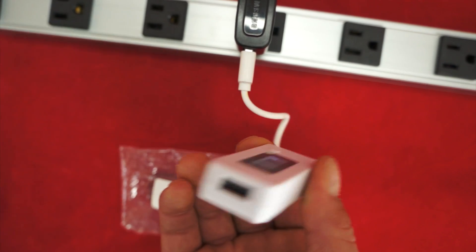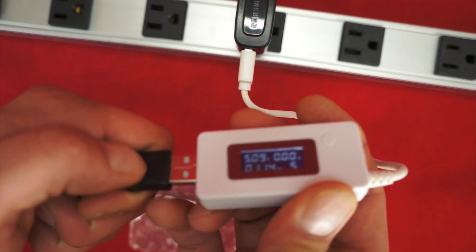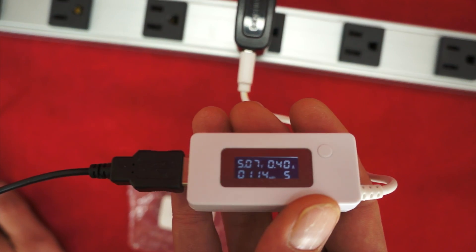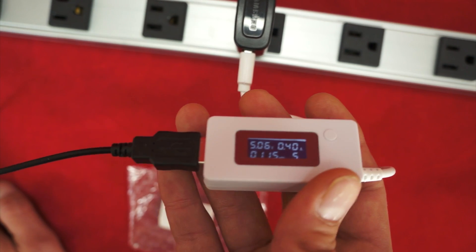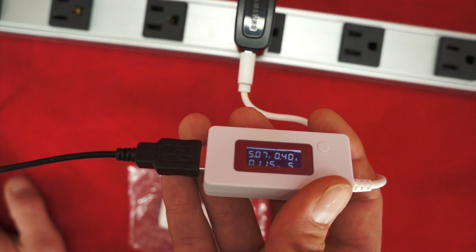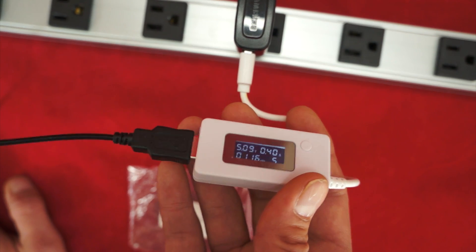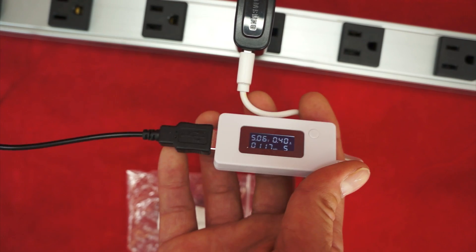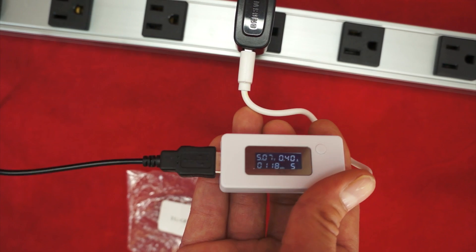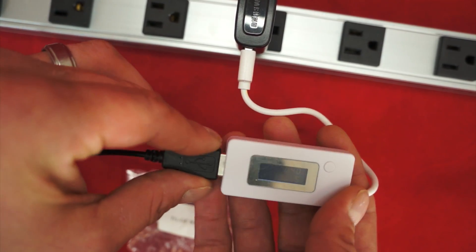The current reads 0 amps because current measures flow — since I don't have anything plugged in there's no flow. I'm going to grab this generic e-cigarette charger. It says it outputs at 4.2 volts at 420 milliamps, so we're going to see if this device reads the same. It's saying 5.07 volts at 0.4 amps, which is essentially 400 milliamps. So the device is not 100% accurate. If you have an expensive digital multimeter it's probably a little more accurate, but this does work well — it gets you in the basic ballpark. I use it to compare to the actual listed specifications, and I normally give it plus or minus 10%, because sometimes it's perfect and other times it's 2% or 3% off.